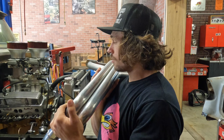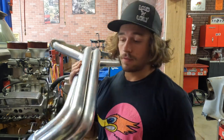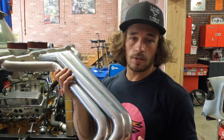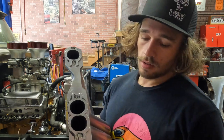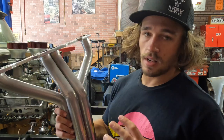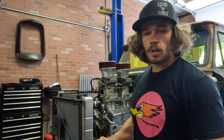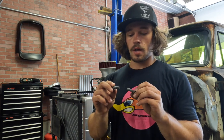They fit pretty well — there's a lot of room left in there, but I did build a custom frame up front. So if you're wanting to do the same thing, these work good and give you a lot of space for steering boxes and all that stuff. They're also nice because they don't require a header gasket — all you do is put a little bit of RTV on there, let it set up for about five minutes, stick it on, and it seals up really good. My header bolts here, I'm putting a lot of anti-seize on them because they're going into an aluminum block. It's important when you're putting regular steel bolts into aluminum that you have a lot of anti-seize so you don't get any corrosion and run into problems when you go to take them back out.